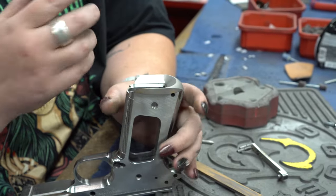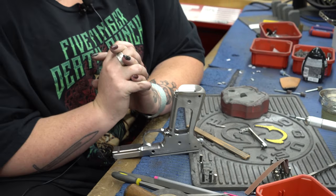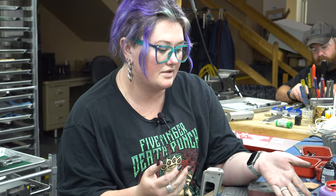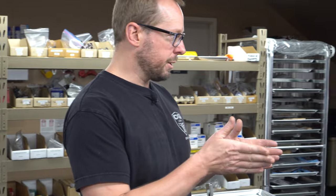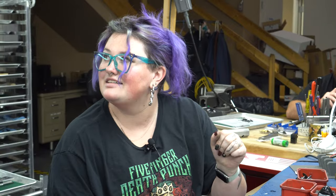After that with the stone, it takes me about 20 minutes to get it close. Then after that it's all just polishing, polishing, making it look pretty, getting rid of all of the ripples that a spinning tool will give inside the magwell. So with the belt sander you're doing coarse sculpting to bring it close to the level of the integral magwell that's already in the frame without going too far. You're trying to bring the magwell down to the frame, but not too much. And then you put them together and blend them as one piece by hand at the bench.